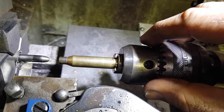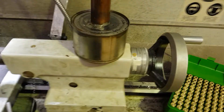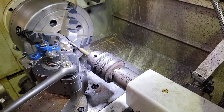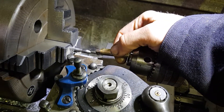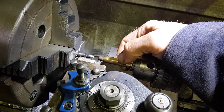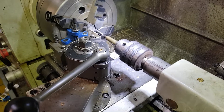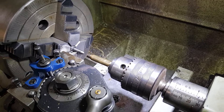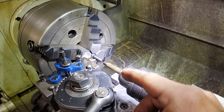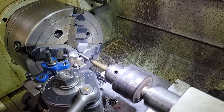What I've got here is a 264 expander mandrel that I use for sizing, and a shell holder in a drill chuck on the tailstock — works quite well. The mandrel drives the case and it just kind of self-centers in the shell holder. I've got all my zeros set so I'm hitting the same spot every time. The mandrel is dialed in to about two tenths, running dead true, so no worries there.